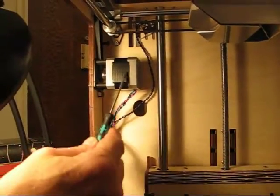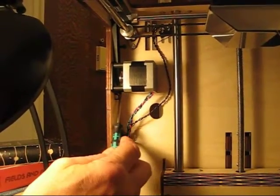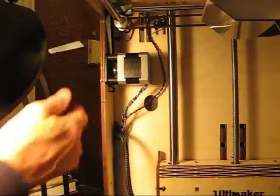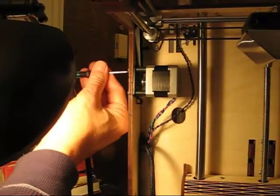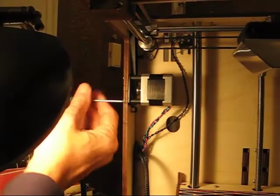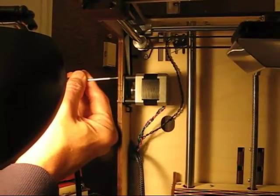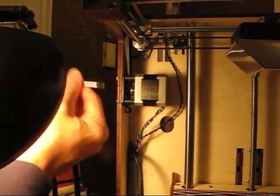What we're going to do is loosen this motor and then push the cable until it's behind here and get it out of the way. Take the back screws and loosen them about four turns, take the front ones and loosen them about two turns.